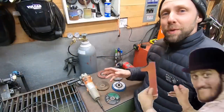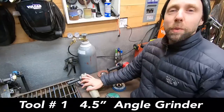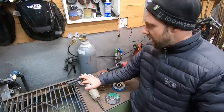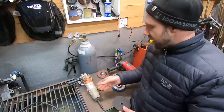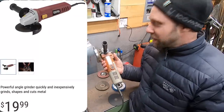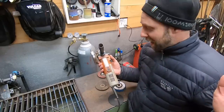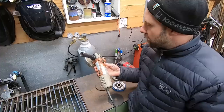The first tool I recommend is a 4.5 inch angle grinder. They come in a range — 4, 4.5, and 5 inch are pretty common — but 4.5 inch I find to be the most versatile for different discs. This one I've had for over 10 years. It's 20 bucks from Harbor Freight. It's nearing the end of its lifespan. It came with replacement brushes and I can't find them, and they're finally wearing out. But it's been a great little angle grinder.